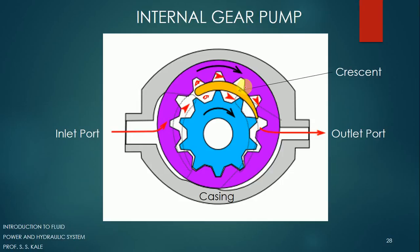As the gears move in the forward direction, the fluid present in this zone moves forward. Fluid is flowing in the gap between the external gear and internal gear and comes here. As it moves forward, you can see that space is reducing — volume between the two gears is decreasing. As volume reduces, the fluid gets pressurized, and after pressurizing, the fluid will go out for the particular application being actuated. The principle is: because of the eccentricity between external and internal gear, space increases on one side and decreases on the other — when space increases, fluid gets sucked in; when space decreases, fluid is discharged at high pressure.